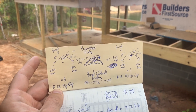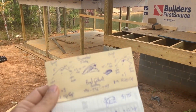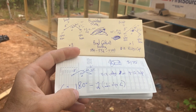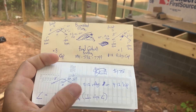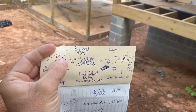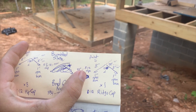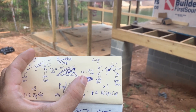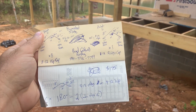We're going to buy eight hip caps and one ridge cap, pop the old ones off, and redo it for a cleaner look. The math to find the bend angle is: take 180 degrees and subtract two times the perpendicular slope angle. For the hip it's five and eleven sixteenths on 12, i.e. 25 degrees; for the ridge it's eight on 12, i.e. 35 degrees.